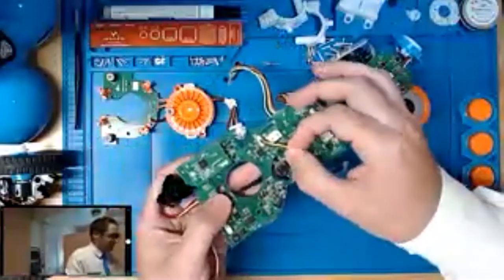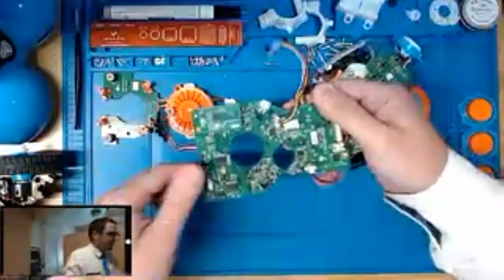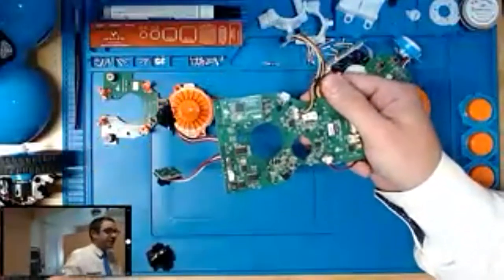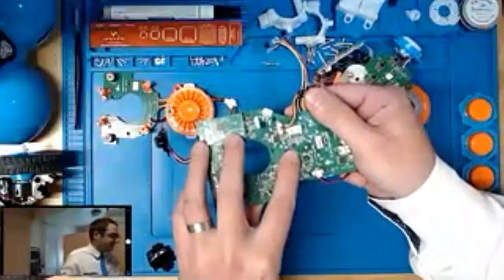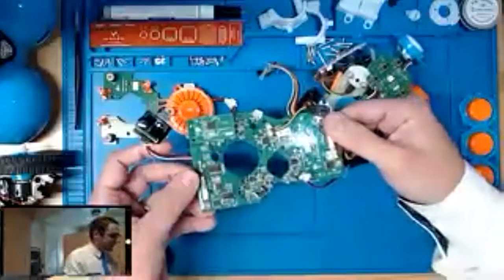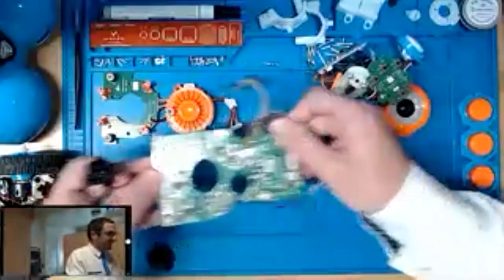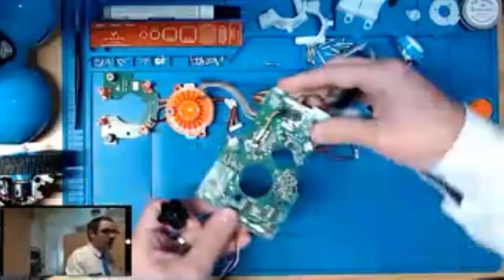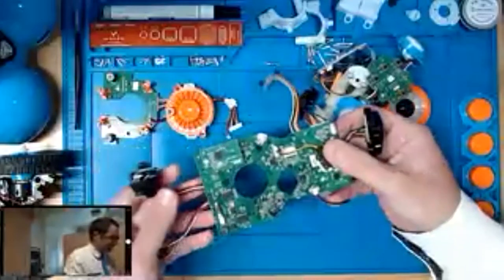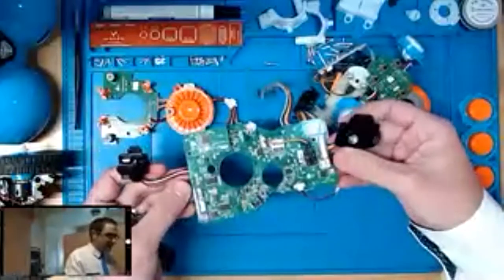And so how we really determine the location and driving skills and, you know, basically the fine tuning movements of Dash, in particular while he's drawing items with Sketchkit, we have a 6-axis IMU. An IMU is an inertial measurement unit, and it basically gives us the ability to detect how Dash is being oriented and how he's moving, both in terms of linear X, Y, and Z directions, as well as an angular direction, such as rotations about the varying axes. So David will explain how we use that information to have very fine control over Dash's movements.